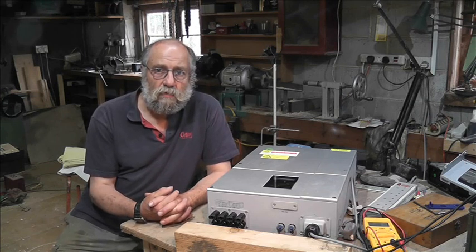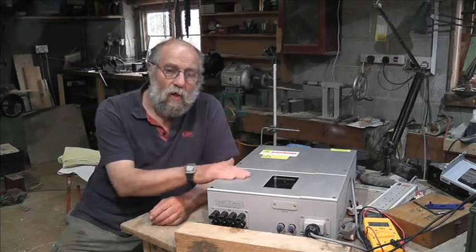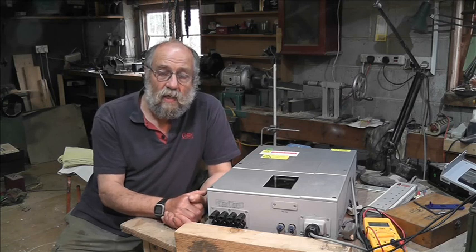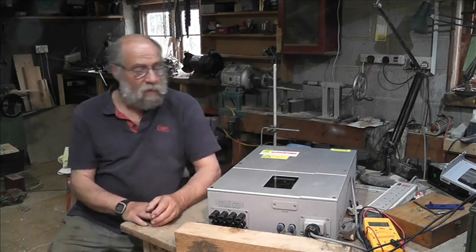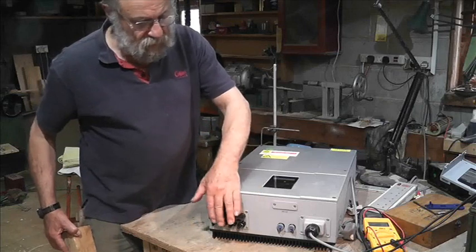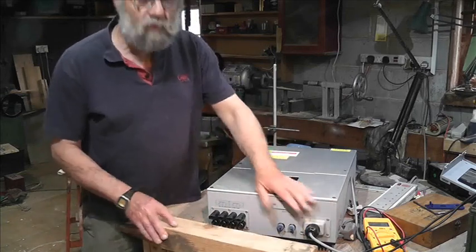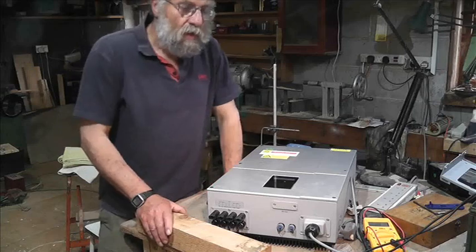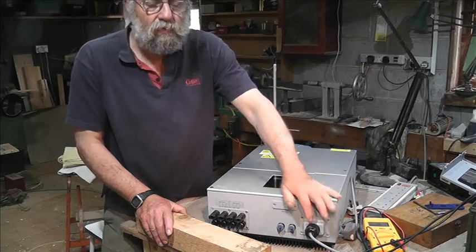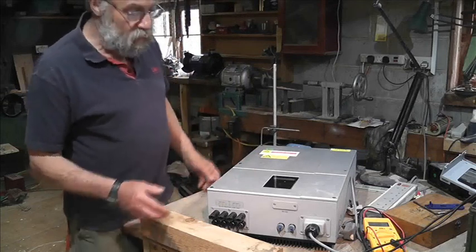Not like the old days when some inverters didn't start until 225 volts, so you could put four panels on this and it would be very under-run, or you could put six on and it'd still be fine. We've got the MC4 connectors there — this is a dual tracker — and we've got the mains there. Interestingly the mains is not a plug; you take this cover off and there are three screw connections.